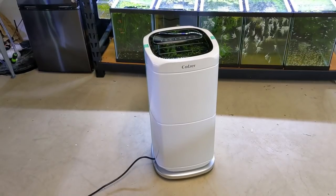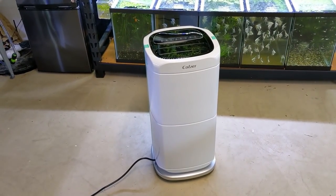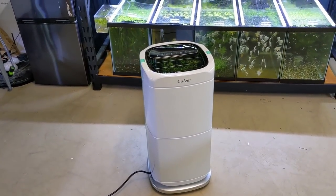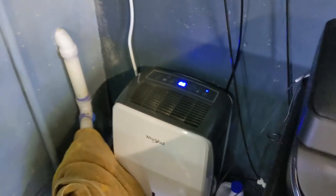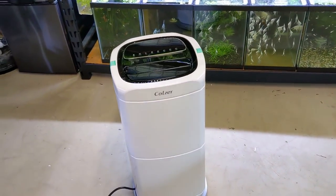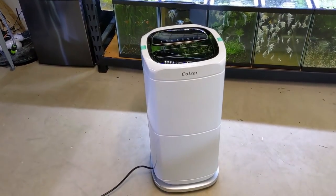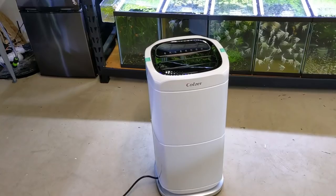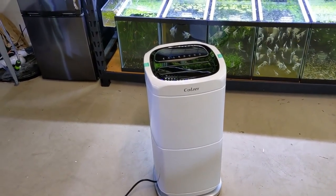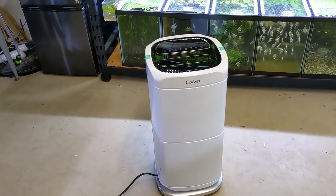Here's the upgrade to the fish room I was talking about - I'm really excited about it. It's a commercial dehumidifier. When you guys support the channel, purchase from the website, subscribe, all that stuff, it allows me to make upgrades here in the fish room. Right now the dehumidifier we're running is always running - it's at 66% humidity, which is too much, and it's struggling constantly. We have a lot of water in this fish room, and even with lids there is a lot of evaporation. This commercial dehumidifier runs 140 pints a day that it will remove from the air, so much more than the current one. I'm also hoping it produces some heat and helps heat the space - kind of get a two-for-one.